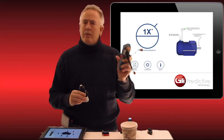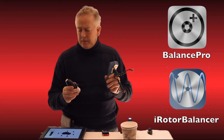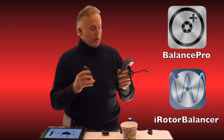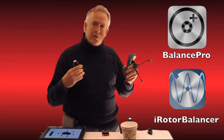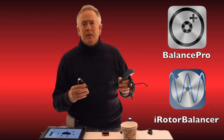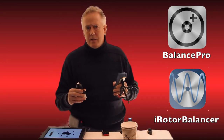What's even nicer is we've got a tachometer that works with all our balancing apps. This allows you to hook channel two into the tachometer and actually be able to wirelessly balance something that you may not want to stand next to, something that's running very harshly, or something you just can't get at behind cages and things of that nature.